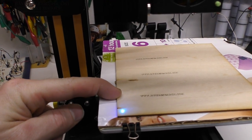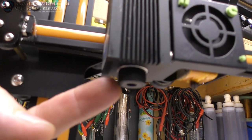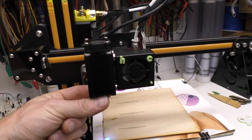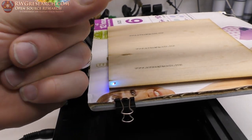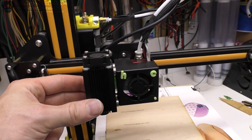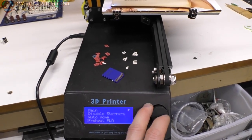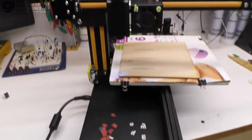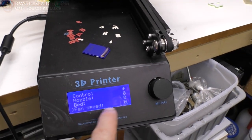Make sure the surface is flat and in a well-ventilated area. You can see it's burning a hole in the wood. You can turn the focus ring to get it into focus. The alternative is moving the Z-axis up and down using the printer settings at 0.1mm increments, which is actually my recommended method — because rotating the focus ring shifts the laser spot and it rotates in a circle, which can be a problem. Once you get it where you want it, turn the fan speed off and run your G-code file.